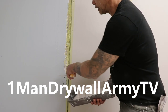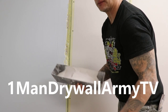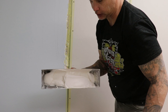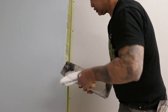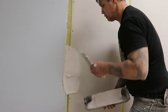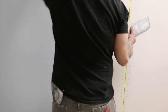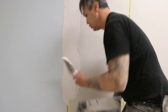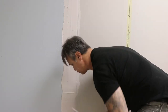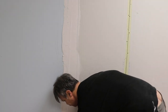I'm going to show you how to fix cracks that are like a half inch big. It's pretty simple. I mixed my mud pretty thick so it's not like falling out of the pan sideways. I just take it and pre-fill the gap like that. You've got to get it in there and just push it through — that'll compensate for the void.